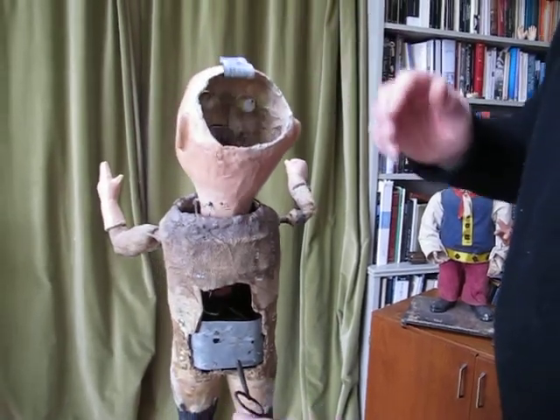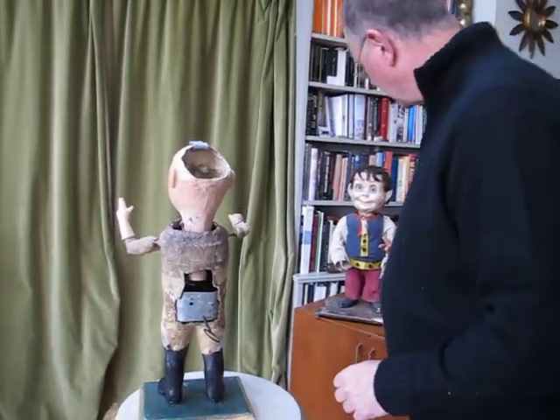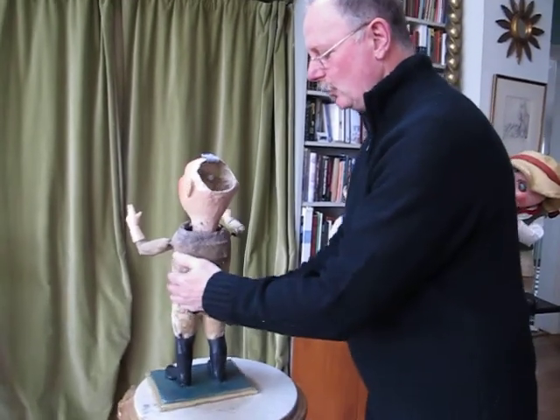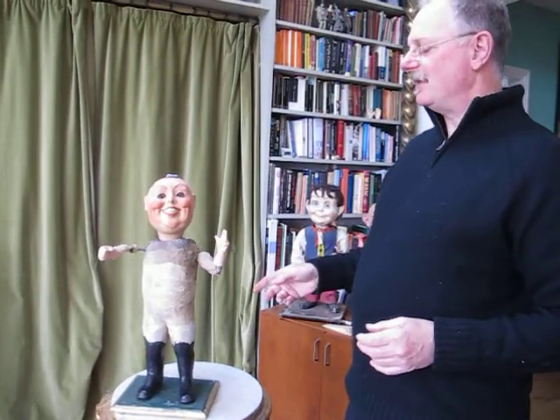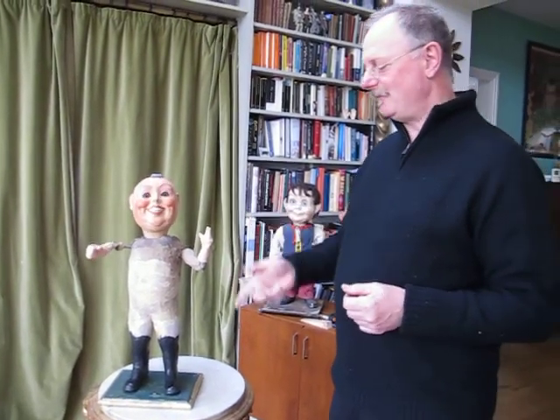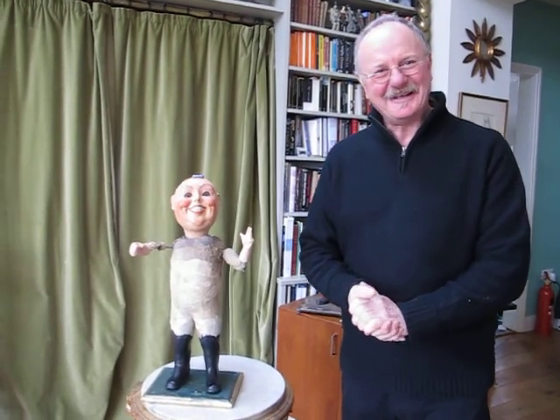Let's see what happens. Perfectly in beat and no wedge. So, lifting the back — bend the crutch upwards; lifting the front — bend the crutch down. And there you have it in beat. Michael Stark, House of Automata. Thank you.